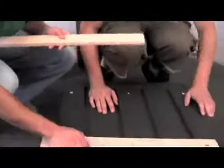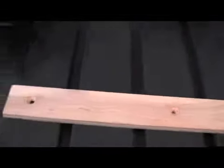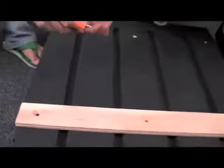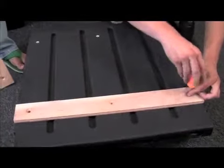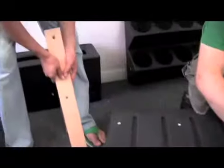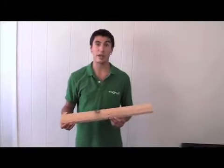The most important thing to note is these brackets have a lip on them. We want to make sure the lip is facing down on the unit. This PC-12 unit is going to hang onto the brackets on the wall — it's going to be just like a hanger system. We're going to put a bracket here and a bracket here, and do this for both of the PC-12 units. We've just installed our brackets.